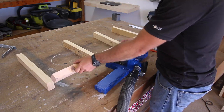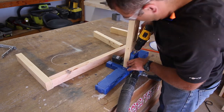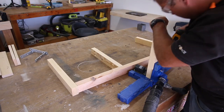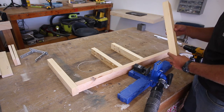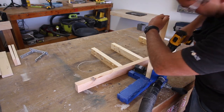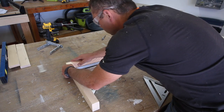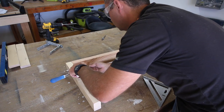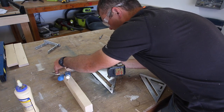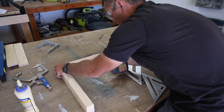These are going to connect to the two outer boards that will face into the room. Next, drill pocket holes on each end of the two inner boards. Moving on to the outer boards, we'll only drill the holes on the end which will be in the front of the desk. Lay the boards on a flat surface and have a speed square handy to make sure everything goes together properly. Use wood glue where the boards will meet each other and then use two-and-a-half inch long screws to connect them. The clamp I'm using is made to fit in a pocket hole, which helps make it easy to get a snug fit and also prevents the wood from shifting.